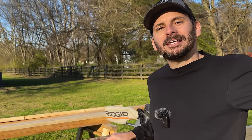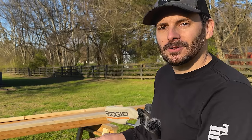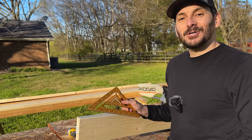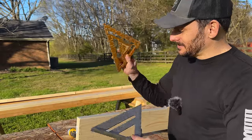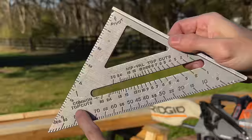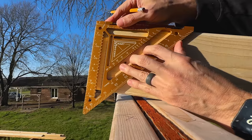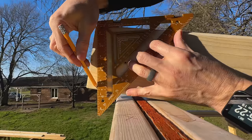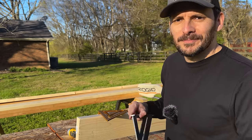I marked this on the front by putting a rafter square against that front header and drew a vertical line up against the rafter as it was sitting up there. That's an easy way to do it, but you can also figure it out using the numbers on your carpenter square. I've got a fancy one but they're on the normal ones as well — it says 'common' and that's your angle. You pivot on the pivot point and when you get to two that is a 2/12. That's a cool way to lay out the pitch when you're using the 2/12, 3/12, 4/12 method.